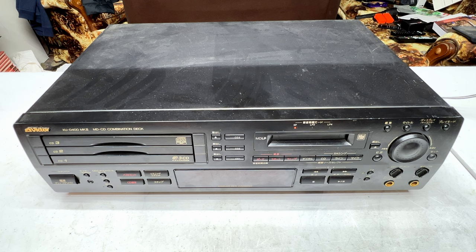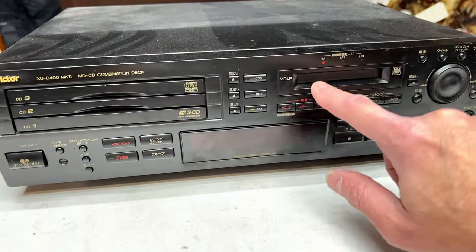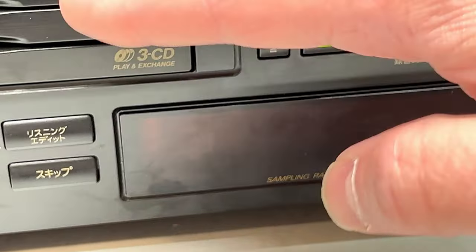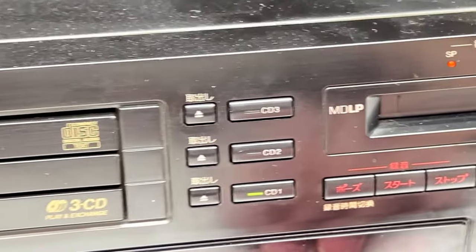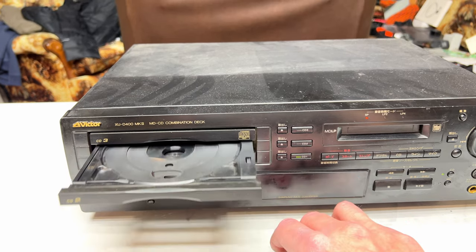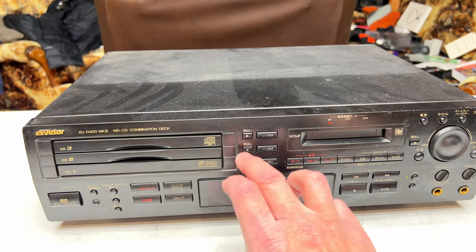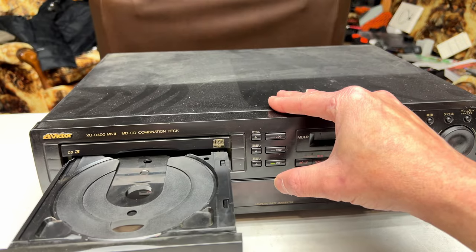Alright, let me get power to it. I heard clunking noises. Power is on. We've got light up here, but we have no vacuum fluorescent display. CD1 indicator is also lit up. Let's see if anything works — I'll try to eject CD1 here. And CD2 ejects — that is not the correct tray. Let's try the eject for CD2. Now we got CD2 to eject its own tray.